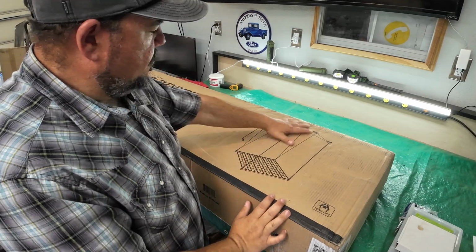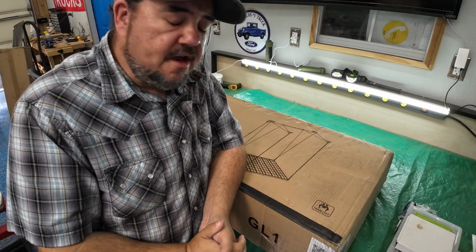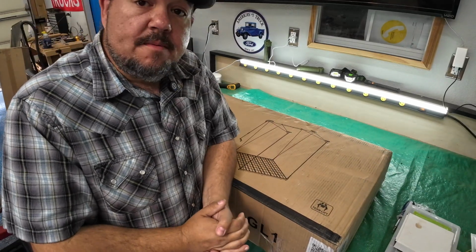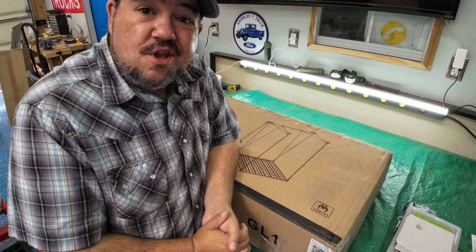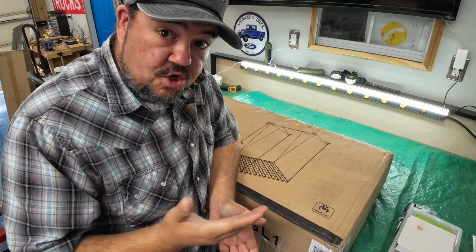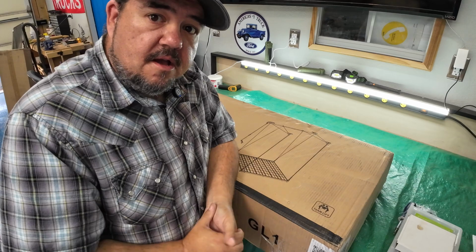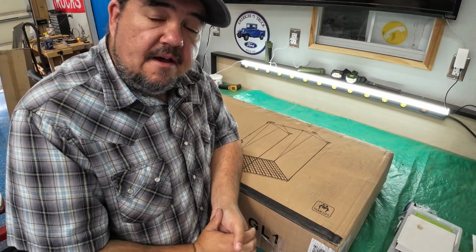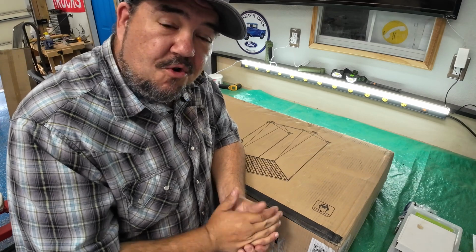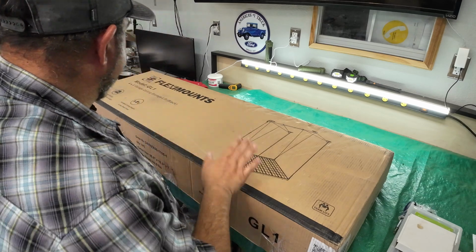So here's kind of a picture of what it is. Basically, it's a lift that's built for your garage or storage area to put some stuff on and lift it up. This thing can lift 300 pounds, so that's pretty good. But it does mean that you have to have it sturdily mounted to your ceiling on some joists. So ceiling joists are generally 2-foot center apart. So this is designed to be 48-inch centers. And luckily my ceiling, even though it wasn't built great back in the day, it was built to that spec. So I'm good there. All right, let's see what we got.